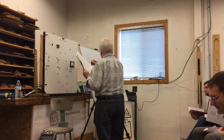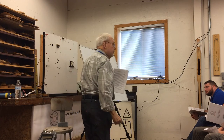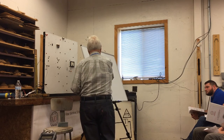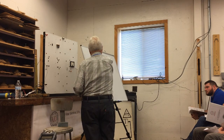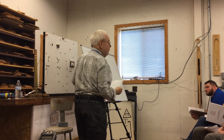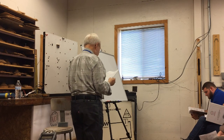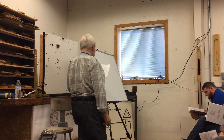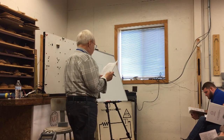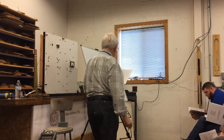Okay, going back to the concept of 0 volts. If we make a graph of AC current like coming out of that wall outlet, it'll start at 0, it'll go up, it'll go down, then it'll reverse, and it'll go back up, ad infinitum as long as you pay the electric bill. So the alternator produces the same sort of thing. It's AC. Not much good for charging a battery. Disastrous, in fact. So we insert the diode.